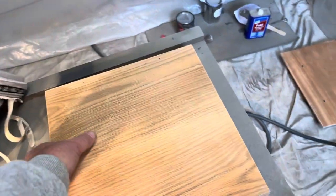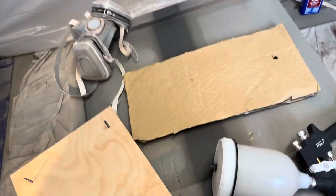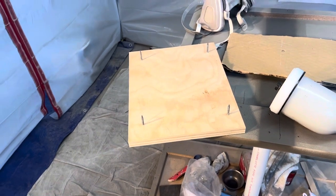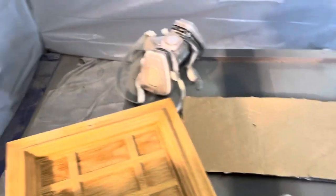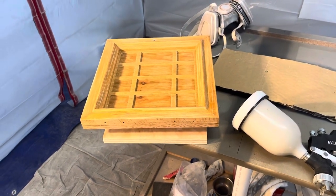And then I will be flipping them over — don't shoot the sides so you can touch it — and flipping it over and putting it on one of these screw boards. Simply a piece of plywood with screws put through them. And you lay it right on top of those screws so you can do both sides in the same shooting.